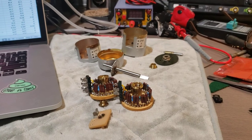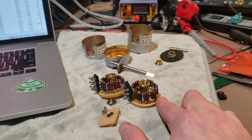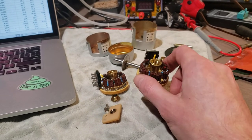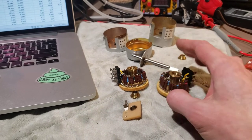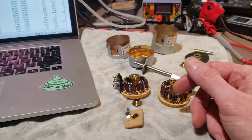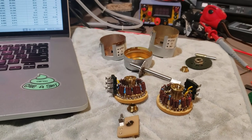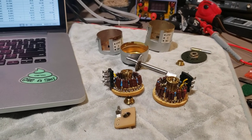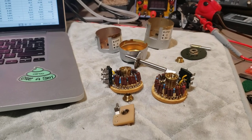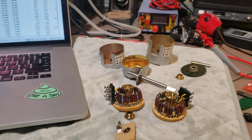So I'm going to put this thing back together. I'm going to have to replace one of those pins that I drove out because one of them broke during removal. I'm going to get this thing all cleaned and lubed and put back together now that all the resistors are replaced and matched up well, and I'm confident that's going to solve the gain difference. Knowing what I know now, I could open one of these and do this kind of repair in a few hours, but it took me probably six to eight hours of work, putting together this spreadsheet, ordering replacement resistors. The next and final Barney Oliver video will have all the bench measurements — frequency response, distortion, power output — and we'll call it done. Good night.